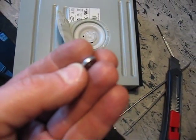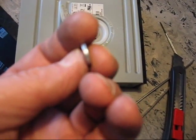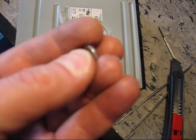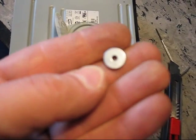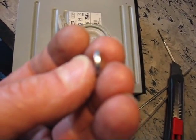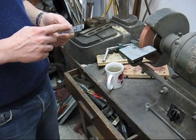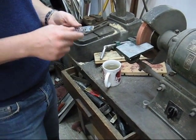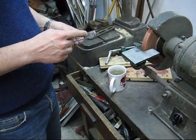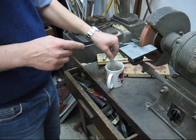And this magnet is in fact too strong, so we have to make it less strong. We should grind it so it is half as thick as this one here. Now we have prepared our magnet for grinding — it is attached to this piece of metal. But don't forget to cool the magnet when grinding, because if you overheat it, it will lose its magnetic characteristics. So we put it into water.